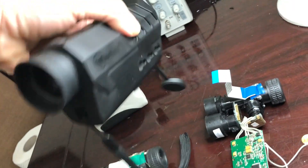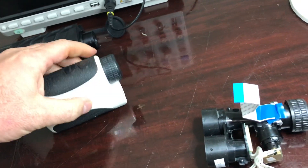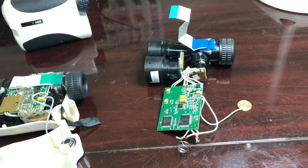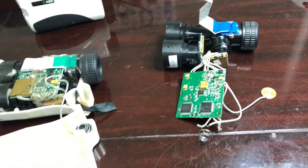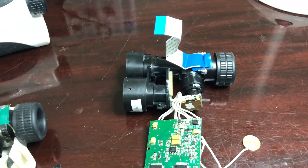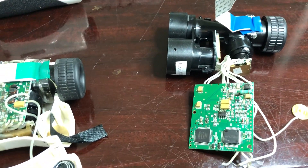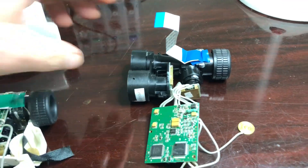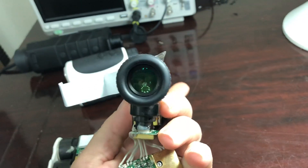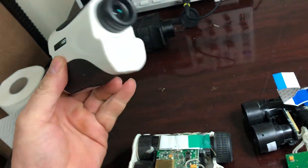The lens and viewfinder here are sensitive to infrared — it picks up the 905 nanometer output really well, and I can view it. If I use my iPhone like I'm using right now to record this, you cannot see infrared — the filter just prevents it from coming through. Even with the high pulse power output of these units, which is about 75 watts, the average power is quite low — it's under 1 milliwatt. This is a Class 1 laser, which means it has to be under 0.7 milliwatts, which is miniscule, but it does the job.